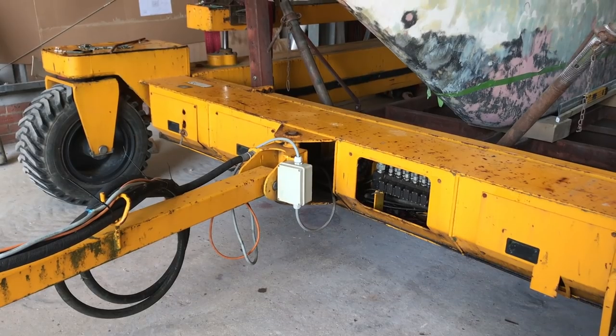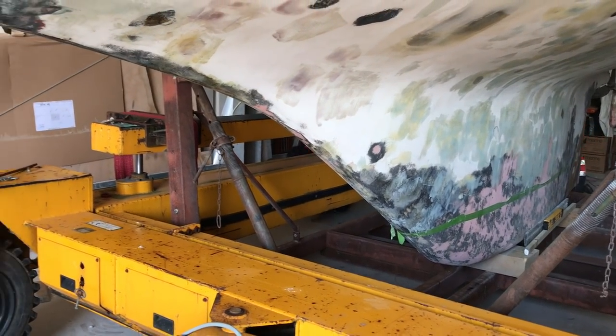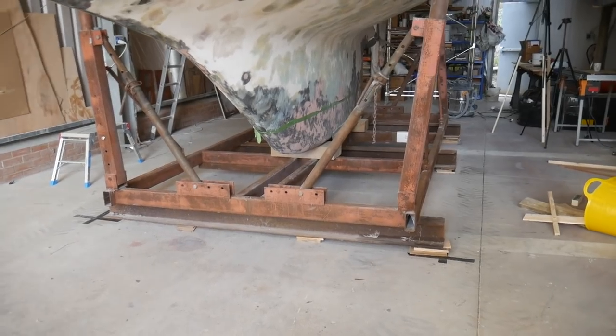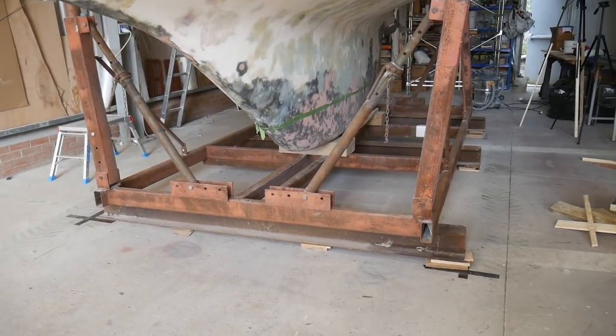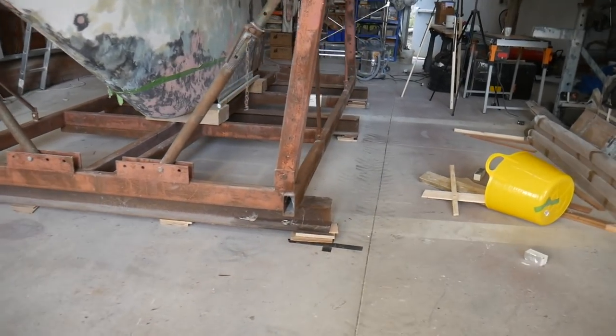Is this existing water line sound? Because if it is I'll just level the boat, forget about the angle of the keel and the cockpit sole, and just get that water line flat so I can use my laser to strike it. The guys from the yard have finished this work now and I must say they did an amazing job - I'm really impressed with the team here. She's perfectly level. Thanks very much guys.